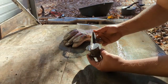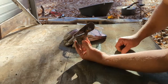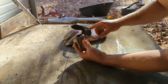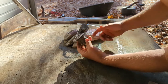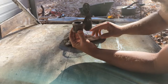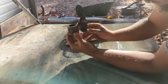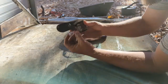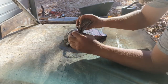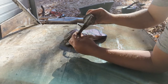Alright, I think I got it. I like the look, I like the weight, I think it'll be fine - quiet it down. But it still goes too far - all the weight's going this way - so I need to weld me a little stop just about right there. I'll have a little more cleaning up, cut this off, maybe tack my nut on, maybe try to work on getting a little more slop out of it.